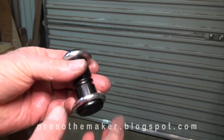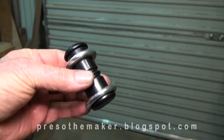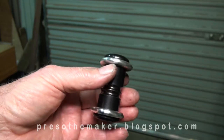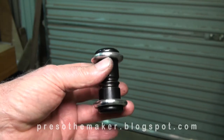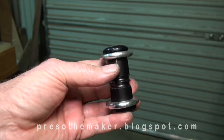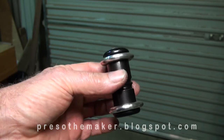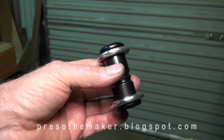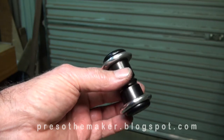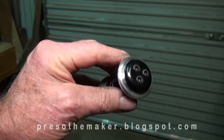The rings are still quite an easy fit on those columns there. I was sort of worried that the powder coat might have added some thickness to that, but it seems to be fine. So the last step now is to get these two rings anodized, and that's the part I'm not looking forward to. It's always problematic. It takes literally days to get it all done because it's got to be prepped and it's got to be chemically clean. It's got to go in the tank for about an hour and a half, and it's difficult to get all eight of those in there at the same time.